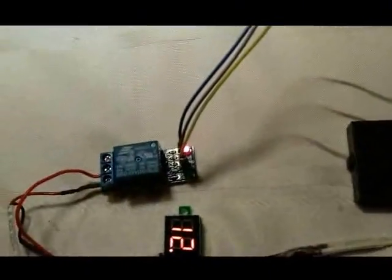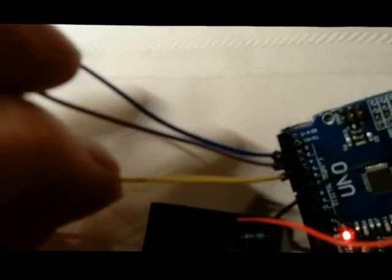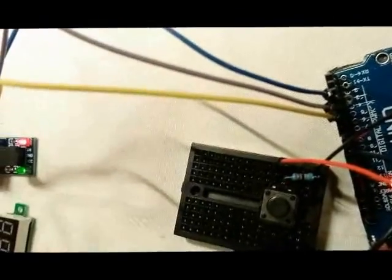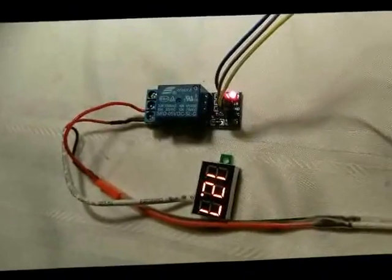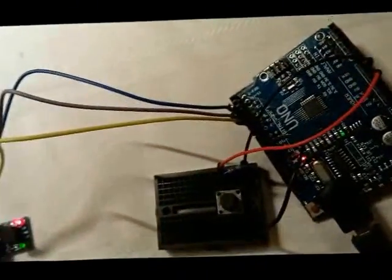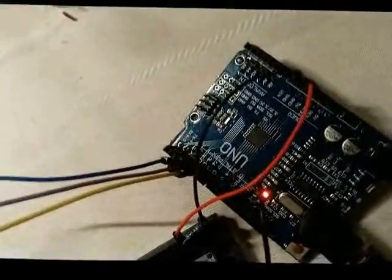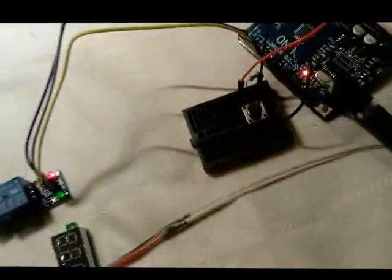Here's how it's wired up. I'm using this relay board with voltage coming in. On the Arduino, I'm using pin 5 set high, pin 4 set low for ground, and pin 3 set low. When I push the button, that pin goes high. You have to hold the button for longer than a second because that's how I programmed it. The switch is wired with the positive going to 5 volts from the Arduino, ground going to the breadboard, a resistor between the ground and the button.